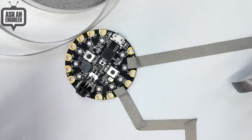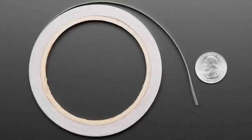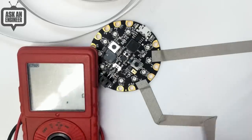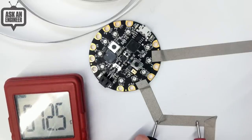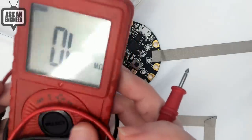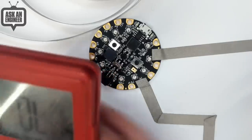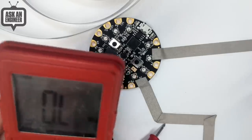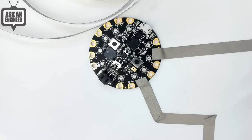We have two different sizes — five millimeter and eight millimeter. It's super low resistivity, very low resistance — only a couple ohms between points. So you can use it to even power small electronics. It's perfect for capacitive touch, of course, and we recommend it for capacitive touch. But you can also use it to power small electronic parts or wearables, and you can sew to it because it's fabric. While you can't solder to it, you can sew to it. Fabric conductive tape just seems to make more sense with a lot of projects.